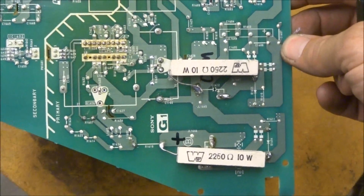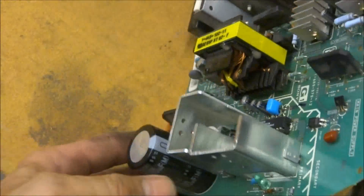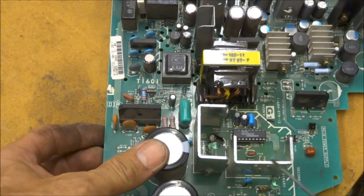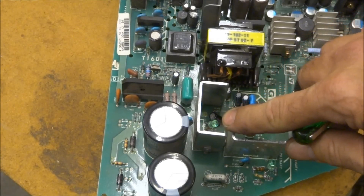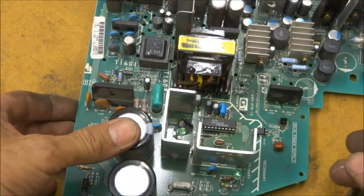One of the things I've done is added a large resistor — a 2250-ohm 10-watt resistor across each of the two main capacitors. They store a lot of energy and I want those to discharge quickly. There's about 160 volts across each 10-watt resistor, actually dissipating about 12 watts total, going slightly over rating — but I only leave this on for a few seconds during testing. I've also added an LED and a couple of resistors here, as well as another LED over here. The heat sinks don't have transistors on them because I'm not actually generating any power — I'm just using this as a test fixture.